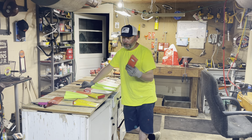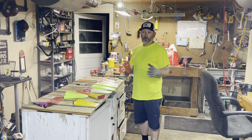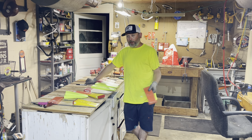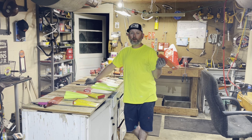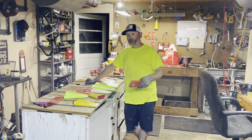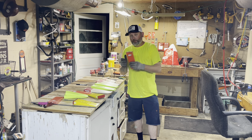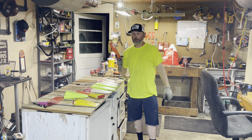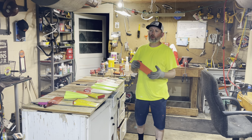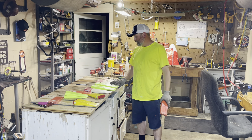I went to the Husqvarna wedges - you get them at TSC too. I don't have any big saw shops around here that carry everything a timber cutter would need, so you just kind of get what you get. Typically whatever dealer you go to, that's what kind of wedge they carry. These new ones I just got are good wedges - they stack good, they're not terribly soft where they mushroom out really bad, but they do mushroom out some. You're going to get that if you use a soft wedge that you can stack. The K&Hs are the same way.